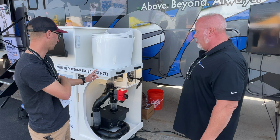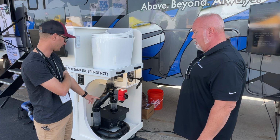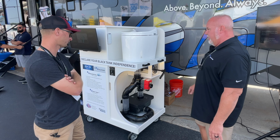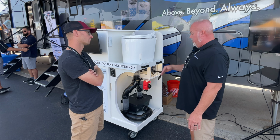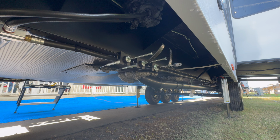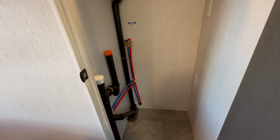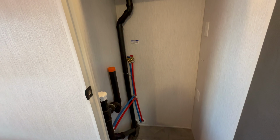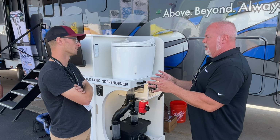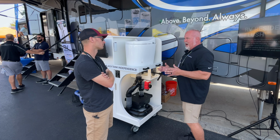Okay, and that was the next one about vacuums and venting. So you're saying the way that you're recommending it be installed is going to allow the vent that's installed with the black tank to vent up through this pipe. Yes. Okay. So you leave the black tank open. Now, if you leave your grays open, the black tank could be closed, because if your grays are tied to the same exit point that your black tank is, you'll be able to use the venting from the grays. But myself, I don't think it would be a good idea to keep it closed, because we know there's debris in there. What happens once you seal it in there? Right. Does it turn into something strange? Yeah. Where if I have it open, at least some air can hit it and dry it out. I would think that's a better condition.